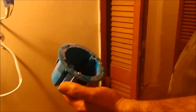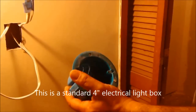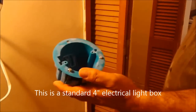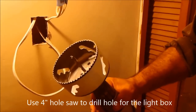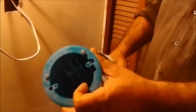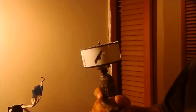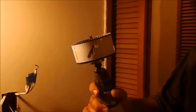This is the box that I put on the ceiling that a light bulb will connect to. To do it I am using this 4-inch hole saw. It is a saw that makes a hole exactly 4 inches. You use it in reverse, not forward, and it will make a very nice cut. You can see it in one of my videos.